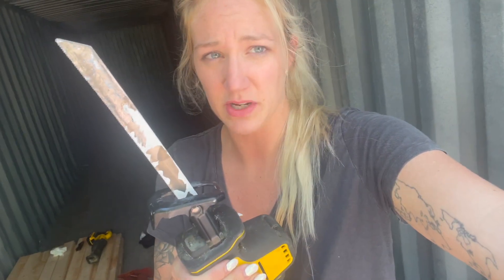If it works I'm going to save myself a ton of time and money on grinding wheels. I'm going to bust through as much as I can with the little wheels, then tomorrow I'll let you know how that giant saw goes. Actually, I also want to try the reciprocating saw - the Sawzall. I originally discounted it because I used it on my trailer build for my mobile studio and it made the metal vibrate too much, pinching the blade. But now that I think about it, that was flat sheet panels. This is corrugated, so it has a little more rigidity. I thought I should give it a shot - and it does work.